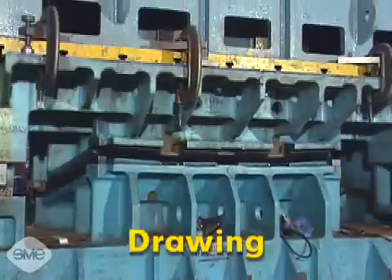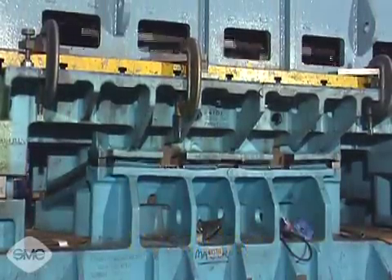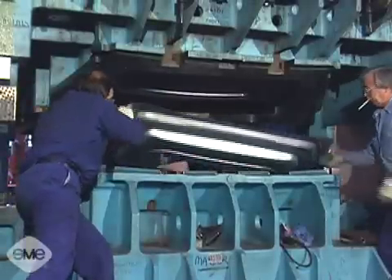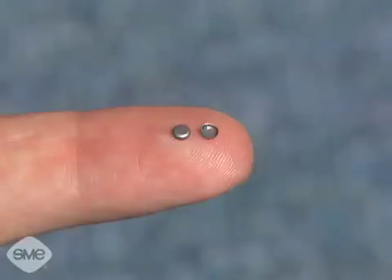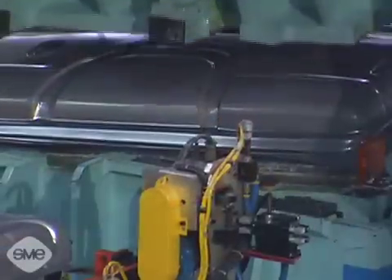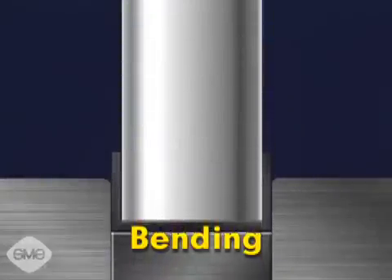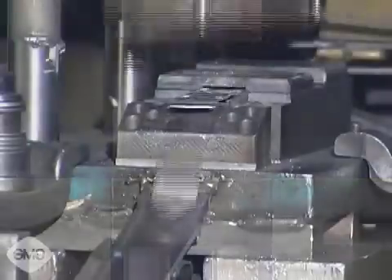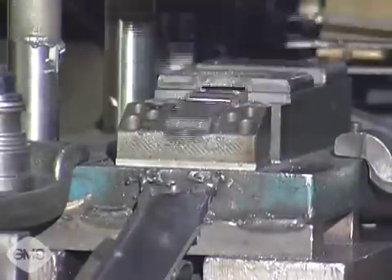Drawing shapes a flat pre-cut metal blank by forcing it into a die cavity with a punch without excessive wrinkling, thinning or fracturing of the metal. Various complex forms may be produced by drawing. Drawn parts may vary in size from small parts up to aircraft and automotive parts large enough to require mechanical handling equipment. Bending is performed on sheet metal to gain rigidity and to produce a part of desired shape, and is usually done to make structural stampings such as brackets, braces and supports.